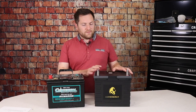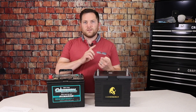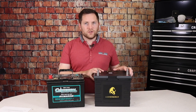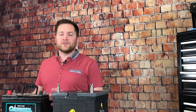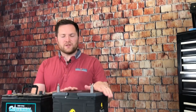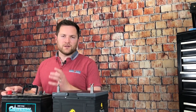Looking at the built-in safety features of this lithium battery: it has a BMS system that will shut off the battery if voltage is too high or too low, current is too high, or temperature is too high or too low. It's there to protect the cells from permanent damage. Lead acid batteries don't really have a BMS system — the chemistry is different and they don't require cell-level protection the way lithium does.